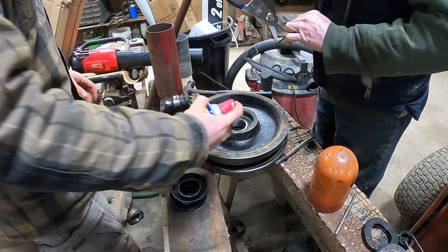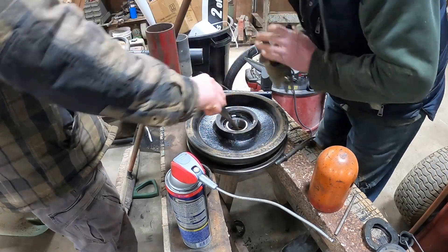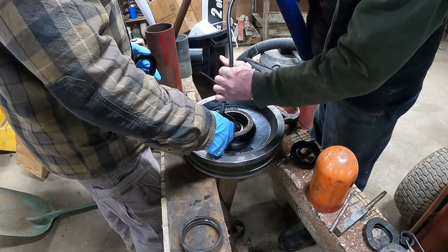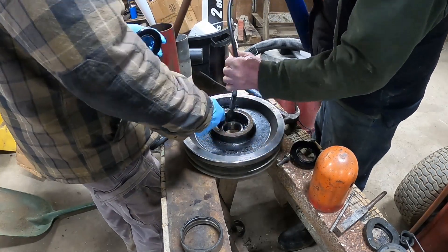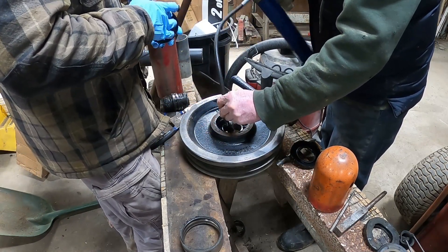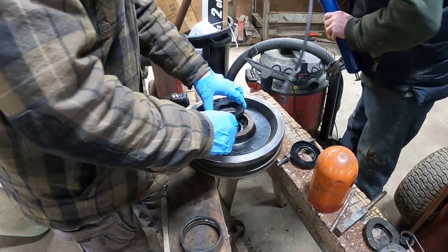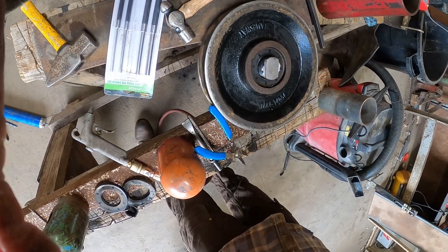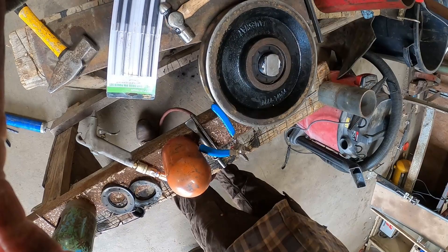Now we're going to put the snap ring on the top side of this bearing to keep it in place. This used to be the bottom of the wheel, but it wore out completely, so there's no longer a groove for the snap ring to go above the grease seal. So this is going to become the top, and we're going to rely on the cover plate to act as the retaining clip for that seal. These wheels, with all the hardware, are $700 a pop, so we're going to reuse them as many times as we can, as long as they still work properly. We're just pre-packing it with some grease, then getting ready to put the seal in, and then we'll flip it over to the other side. Here we have the grease seal on the other side, the shaft in with its two small snap rings, and I'm just getting ready to put the final snap ring on the bottom side of the grease seal.